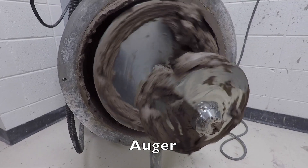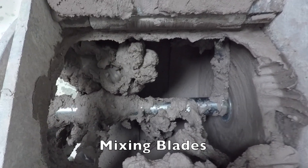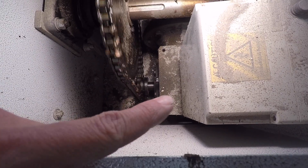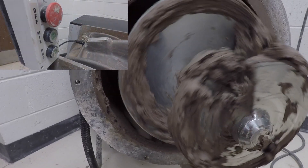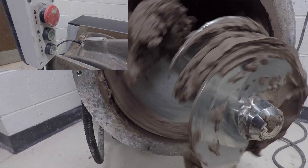And here's the auger on the inside — pretty cool. The auger and these five mixing blades are attached to a shaft, and on that shaft in the motor housing is this hub or gear-looking thing. With the help of a chain, the hub is attached to a small motor at the back of the pug mill. A pug mill has two settings besides off: Pug spins it forward and forces clay out; Mix spins backwards to mix clay inside the chamber.